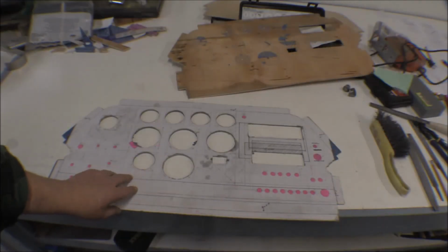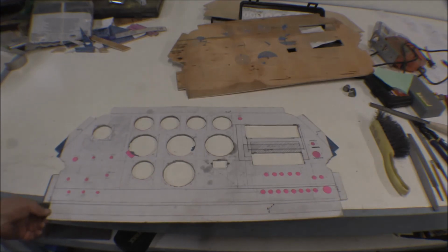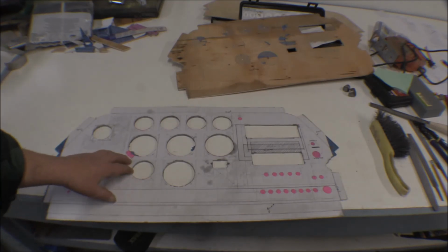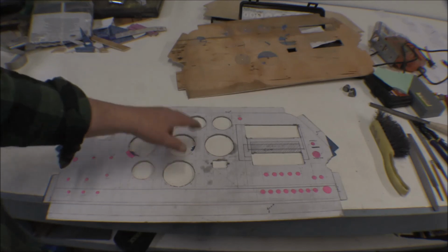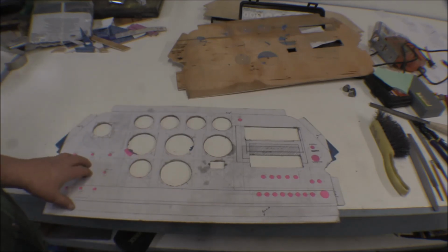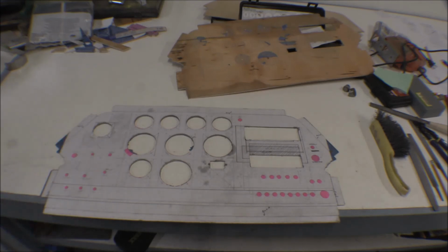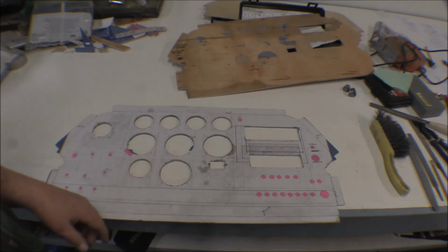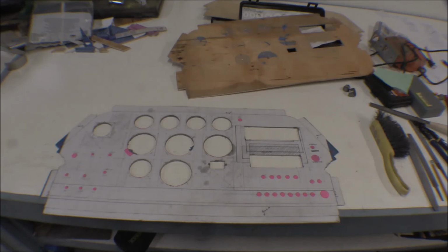I went around the perimeter and deburred the edges on the back side after taking that plywood off. This cardboard is too thick on this side to do that, but I'm going to leave that template on there until I bend these flanges over. So that's the next thing to do, is to bend this, and it's the right size that I can fit it in my brake, my 3-in-1 Grizzly brake, so I can go ahead and bend all those tabs here. I still have to notch out a little bit around here for the altimeter, but all these other holes and everything I can put in afterwards.